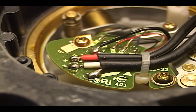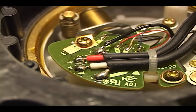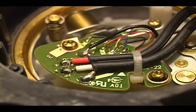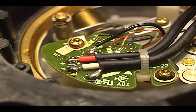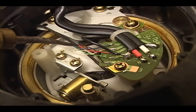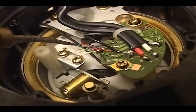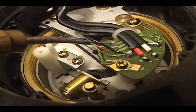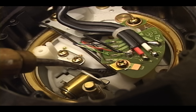You've only got about an inch of wire in there — you don't want a lot of extra wire in that space. This wire here is the ground from the whole turntable. Technics was very careful to make sure it was kept very flat, because you've got all these moving parts in here. You cannot have any of these wires — except the tonearm wires — moving, because if they interfere with the movement of the tonearm, it'll interfere with tracking and you could end up hearing the same loop over and over again for your entire DJ set.